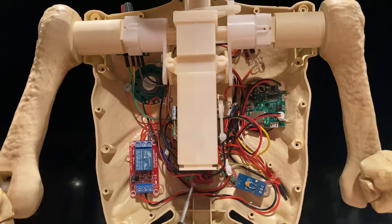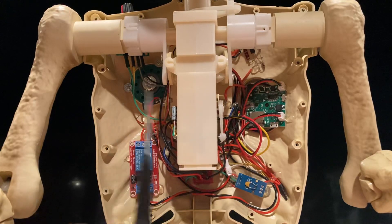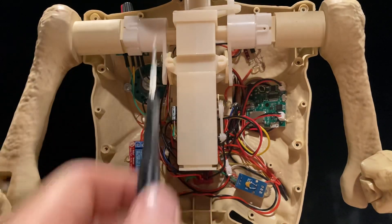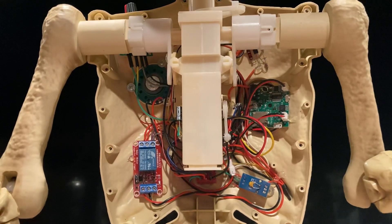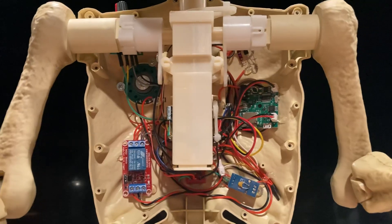The busy line runs across here — this white wire right here. As long as it's set to high, I had to set the relay to high on this one. So when that signal's high, this relay stays closed, keeps the motor energized, keeps the LEDs and the eyes lit up. But I can bypass that, which is kind of nice with the mode switch — you have a little more options. And then I may do a bypass on the infrared.